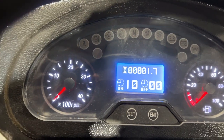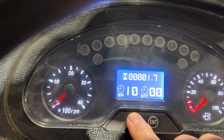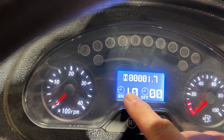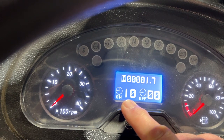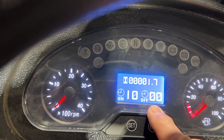These lights in the middle — you can digitally set your time on and time off for your sprayers. It has your hour meter up top, and right here, by one-second increments, you can set how many seconds you want it on and how many seconds you want it off, so that you can dial in the water system perfectly. I would call this a big roller feature in a small package.